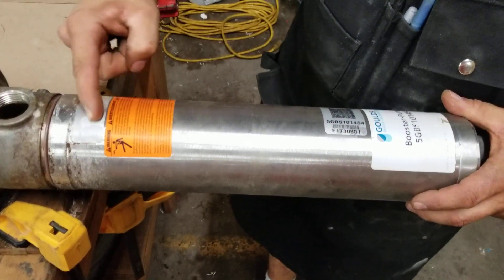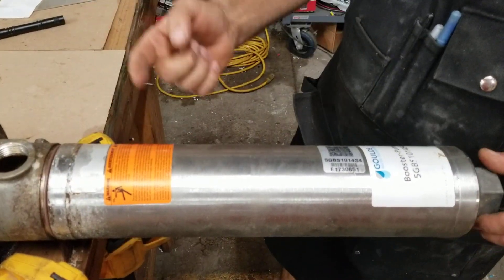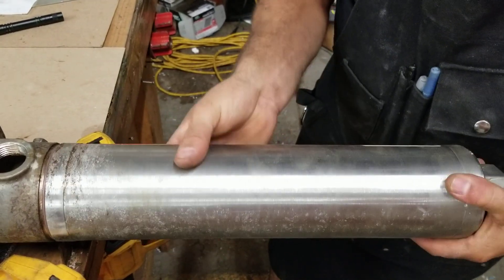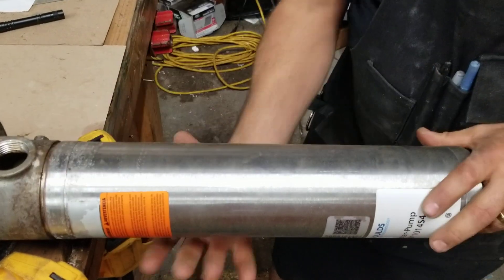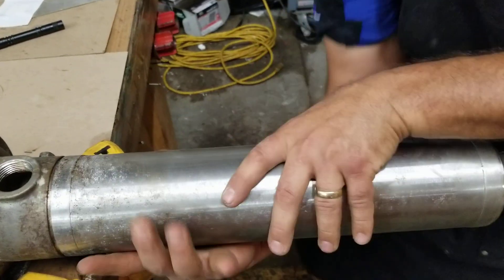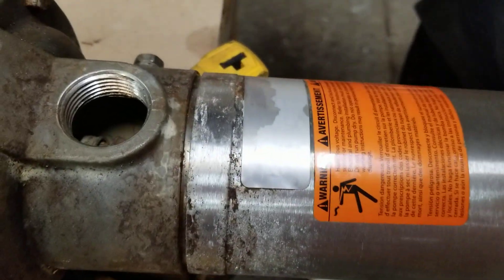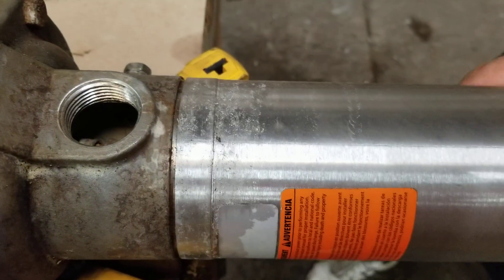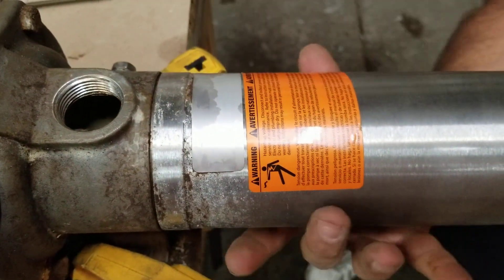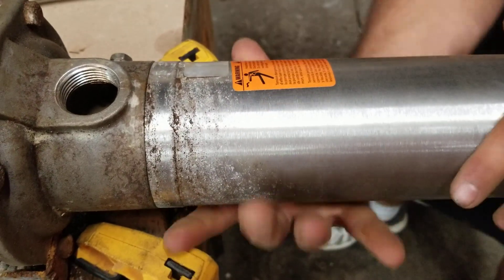There's typically an arrow here — this is a rotational unit and it does spin counterclockwise, so it is a reverse thread. We're going to slide the barrel on. What's nice is when you have everything on there, the barrel actually slides on and guides itself onto the threads really easily. I'm just going to turn this and hand tighten it all the way up — it should end up right where it was before. There's still a little bit of gap there and one more turn to go around, and it'll probably stop just short of where I can turn it.